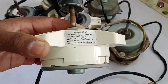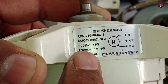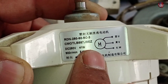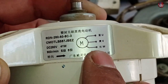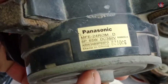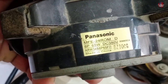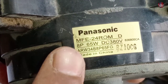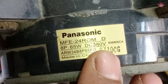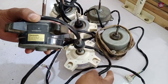The specification sticker is present on this motor. This UVW motor operates on DC 280 volts, with a power rating of 41 watts, and UVW is also mentioned alongside the wires. Now for the simple five-wire DC fan blower motor — this one is a Panasonic DC fan motor, rated at 65 watts, operating at 380 DC volts. This is how we can differentiate these motors through their specification stickers.